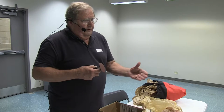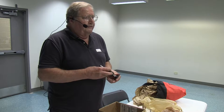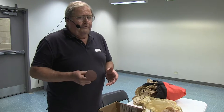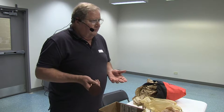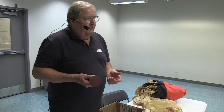If you continue with the next grit and the next grit, you really don't get that mark out until you've highlighted everything around it. And I think a lot of people over-sand a bowl or anything. On a bowl, any face grain that's showing eats up much faster than the end grain, so you can get hollows in there. So you want to keep that as flat as you can and go through and get a nice finish. When you got that, where all your imperfections are out to the 100 grit, then move on to the next, maybe 120. Continue as you are. If there's fine stuff in there, you may have to go back to the 100. I'm not against going back to the 100.